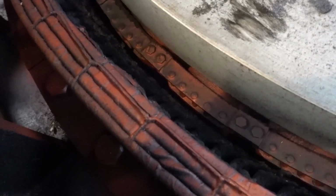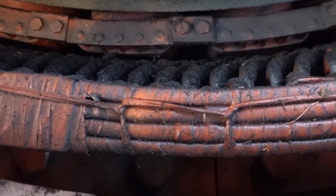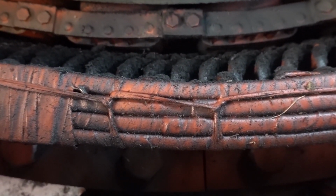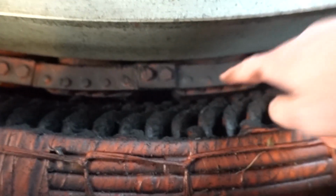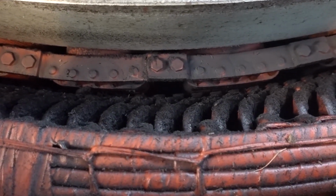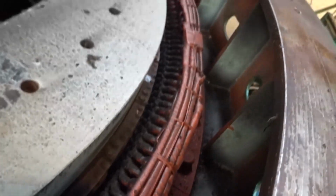You can work it out empirically, mathematically, by knowing that the rotational speed of this generator is about 210 RPM, and we're generating 60 hertz three-phase power. So how many poles do we have? All the EEs have got this in like 30 seconds. So these are the windings covered in schmoo. It's just nasty.